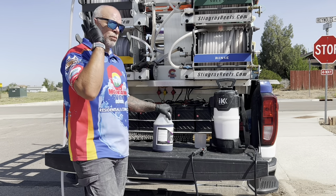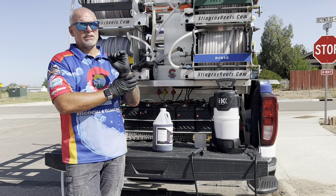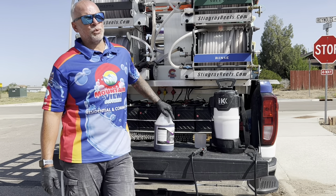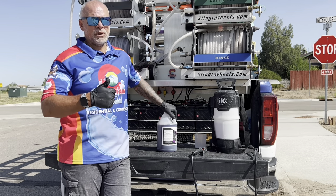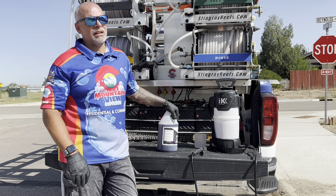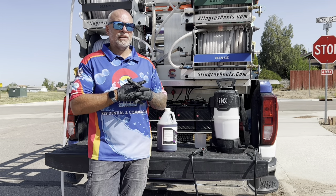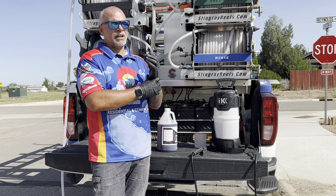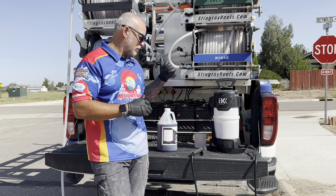What I'm going to do first is my normal wash. Today we're not going to do anything too fancy — in fact, this house has zero organics on it. So for me to use sodium hypochlorite or bleach on this home, I think it's just a waste of product. It's not even that dirty. Typically I'll add a little bit of bleach because it bumps up the pH levels on our soaps, but today I just don't think we need it. So I'm going to do a real light application of our Terra wash, which is our dirt emulsifier, and a little bit of our green wash to get some more surfactant in there. It does have a biocide in there, so potentially if there are some organics going to grow on the north side, that'll eliminate that.